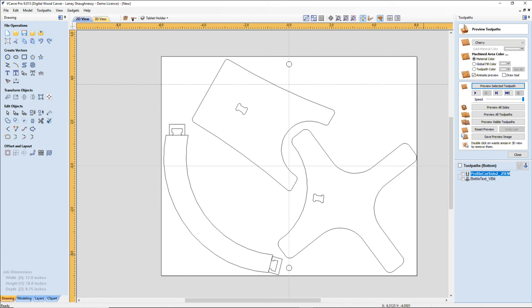As long as one doesn't make my part wider than the other, because I want those fillets to be hidden. I'll take a closer look at that, and I'll let you know on Monday about the dog bone fillet. I know the dog bone pushes out the front and the side, right? It pushes out from the corners, creating that dog bone look. And I just don't want my corners pushing out further, because that's the widest part of my design, and then me having to compensate like I had earlier by making my tenon smaller. But we'll look at it and I'll let you guys know. Would nesting tool help? Yes, it would, Dennis. The nesting tool would have been wonderful if I would have used it for those three parts.